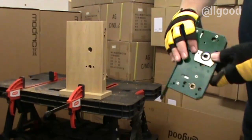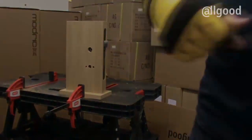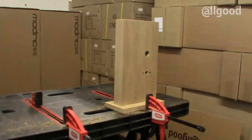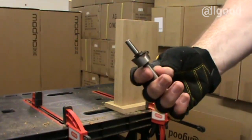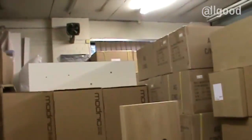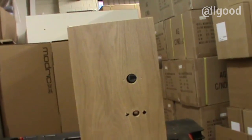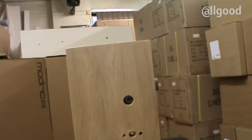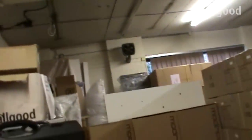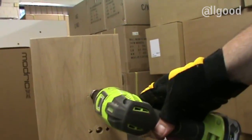At this point you can now fit your prepared lock into your mortise and secure it in position. We'll now finish the door prep for the top lever, which fits on the outside of the door. The first thing we need to do is use the piloted cutter. The reason we use this is that a hole made from a template wasn't always perfect — working from a template, you can't always be sure that you've got the holes exact. So the piloted cutter will locate into the follower and ensure that your final hole is absolutely perfect.